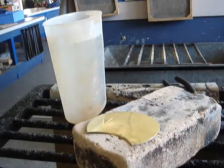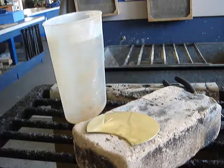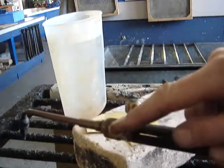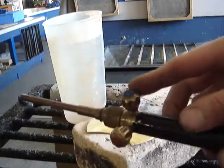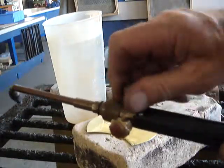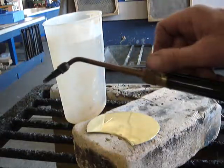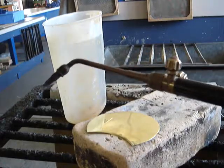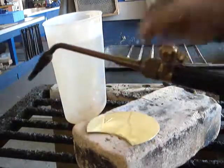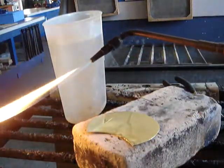This is our welding torch. It's got two controls: the fuel, which is red, and blue which is oxygen. We're going to open them both gently and close them gently. Now we open the fuel one — about an eighth of a turn — and then use the flint lighter to ignite it. We've got a flame, and we'll open that flame up.